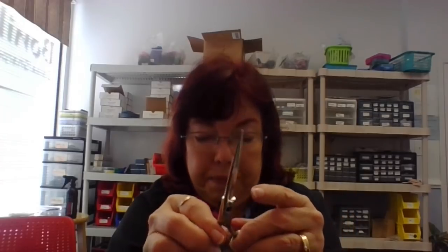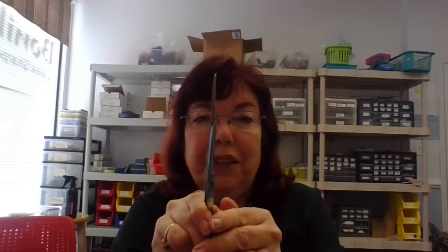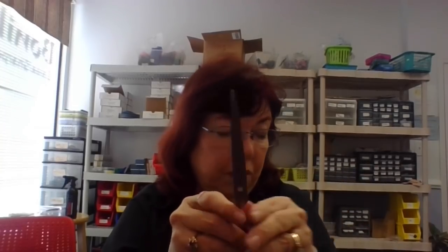is workable. As I said, I'm not a high risk taker, so I wouldn't try to fix one that's slightly out of alignment. Some of these guys would. However, once in a while you will come across one, and this one I did on purpose. You see how bad that looks? I did this one really bad so you could see what's going on. And once in a while you'll come across one that's so bad, at this point I would probably just walk away from it. But if it's beyond what you can do and there's no way you can get it to cut without bending, hammering, or making adjustments on that alignment, now you've got a choice of what to do.